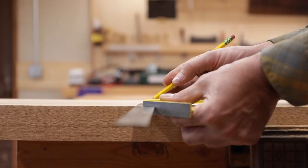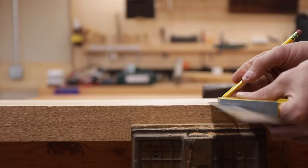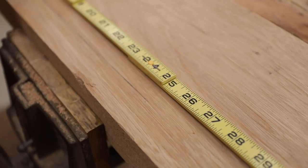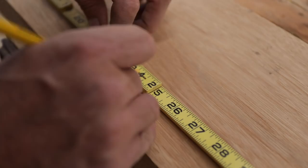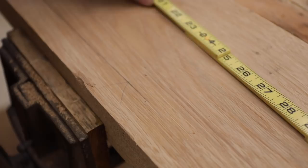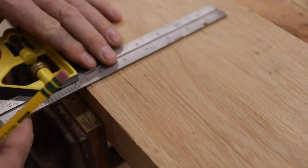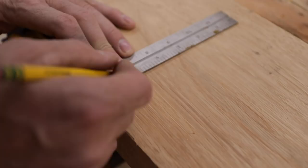A combination square is an amazing tool. For most guys you're going to want a couple of heavy mauls and hammers. For the larger two-handed hammers, you want a ten-pounder, and then a seven-pounder is nice. What I see oftentimes is that the handles on these seven-pounders are too long. What my granddad came up with after a lifetime of use was about 24 inches — short, yes, but you can use it in confined areas. With your big ten-pounders you want a full-length handle, about 32 inches, but this seven-pound will be your go-to hammer. You will absolutely love it — it's just so versatile.